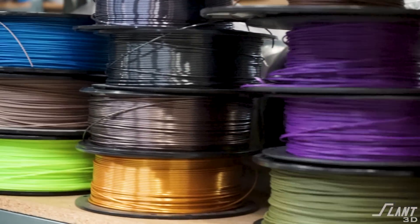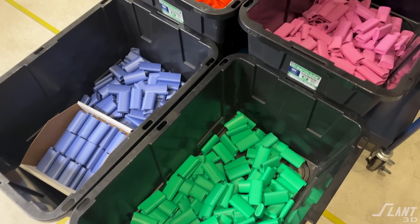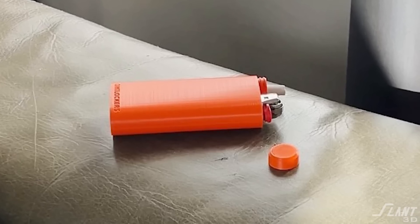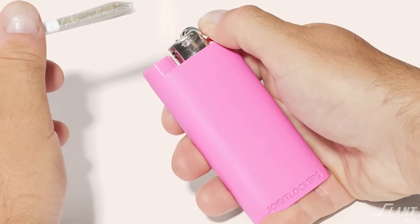If you vary the colors of the part — going from orange to pink, for example — you have completely changed the dynamics of the model. The colorant inside the material changes its properties, so slicing settings created for one color would not necessarily work for another. While we could create a recipe for every single color, at large scale you don't want that much variation — it creates complexity and introduces opportunities for failure. So we had to make a robust set of slicing settings that were universal across all color profiles, matched with the CAD design specs, so there were no visible problems.